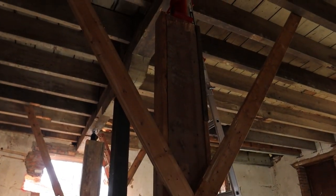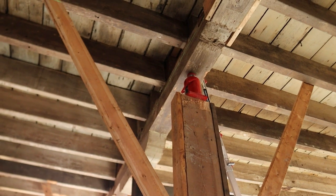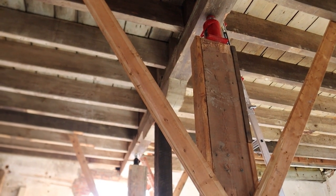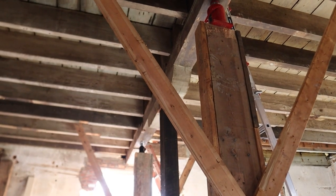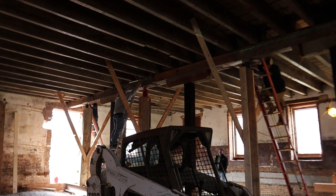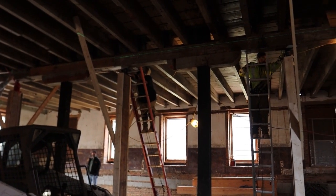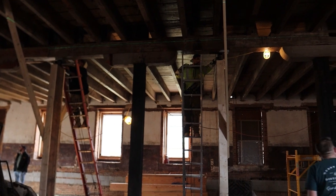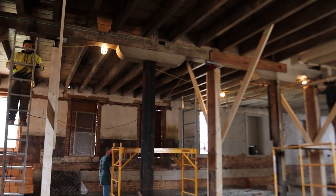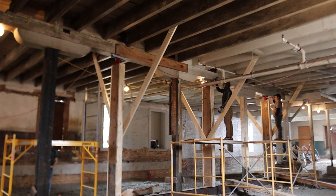And you can see on the other side, here's a close-up of the jack post. This jack post held up, in that case, a 50-ton jack. That jack could pick up twice the building that it did pick up. The jack behind it's only a 20-ton. But you can see how these are all going across the building, and we're getting all ready, just having one man per jack. Everybody at this point is manning their stations and getting ready to lift.